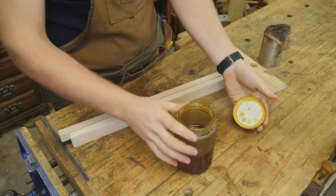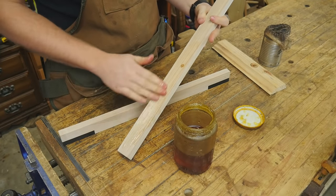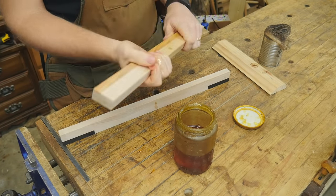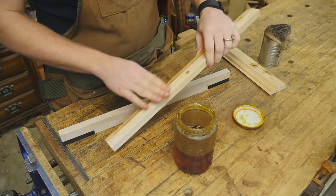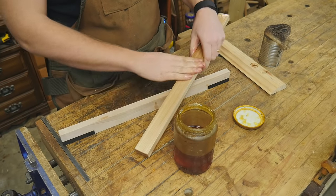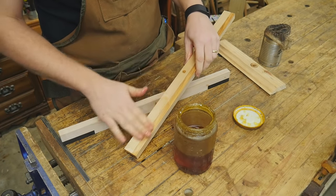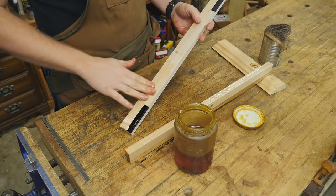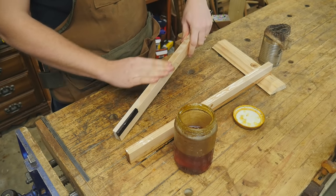For finish on all my hand tools, I use boiled linseed oil and paste wax. I'm just going to rub it on — this is real boiled linseed oil; if you're going to be using the store-bought stuff, probably wear gloves. I'm just going to rub it on and let it soak in. Then I'll come back in about 15 minutes and I might put a second coat on. Here you can already see how that middle pin is really standing out because the end grain just soaks up the oil — it really absorbs into it nicely. The weird thing about the ebony is when I put that on there, not much changes other than it gets a little bit glossier. I'll set them up on a block here to lift it up and make sure that air can get to almost every space all the way around. I'll come back in about 15 minutes and see if we need another coat — if not, paste wax.